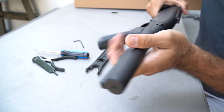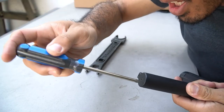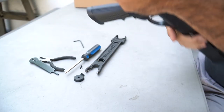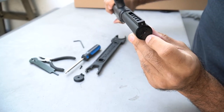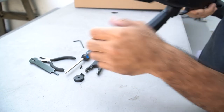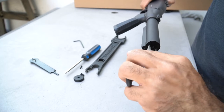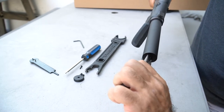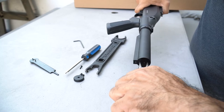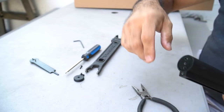Lastly, there's an O-ring inside here. Take off this little vanity plate — it's two Phillips screws, one long and one short. You'll see a couple holes: the center is for the Phillips head screw, and these two slots are what you'll use your needle nose pliers on. Righty-tighty, lefty-loosey — gently turn it. You might scratch it in the process, oh well. Pro tip: if it looks flush, it's probably not tight enough — just crank it a little bit more.